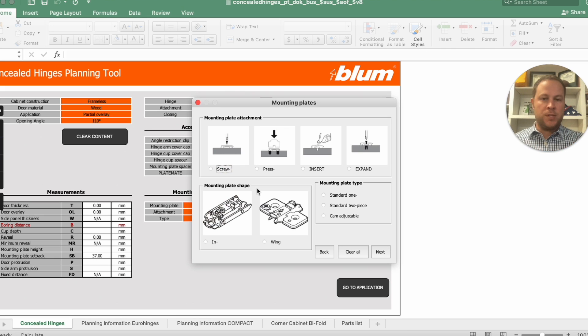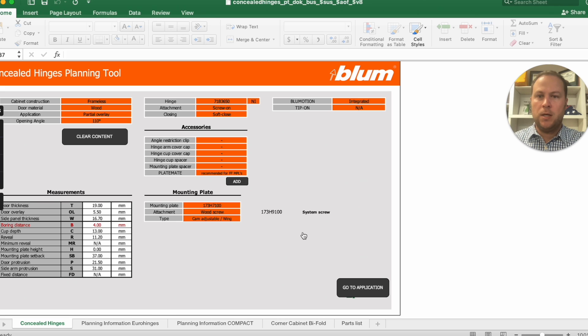This additional information goes beyond just drilling the hinge hole. We're focusing on using the Kreg jig to drill the hole, but the hinge also has to be hooked up to your cabinet, so I have the screw wing mounting plates. These are cam adjustable. I'm working backwards since I've already bought the hinges, but you can work forwards and the workbook will tell you what part to buy. Based on what I've entered, it's giving me the part number from Blum for a frameless wood partial overlay 110-degree hinge.